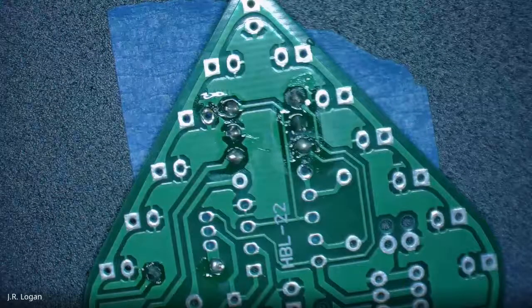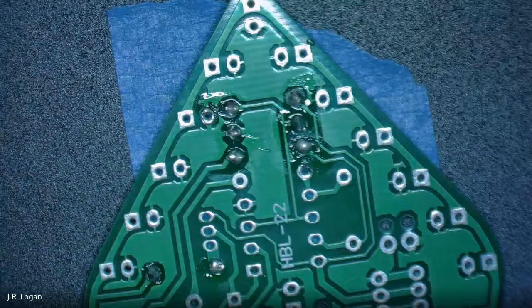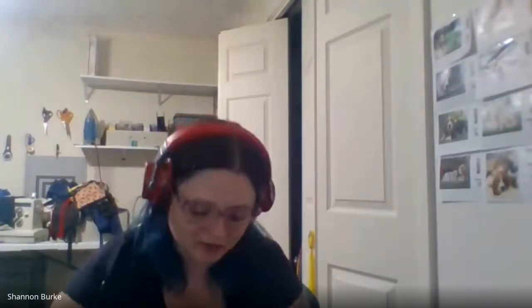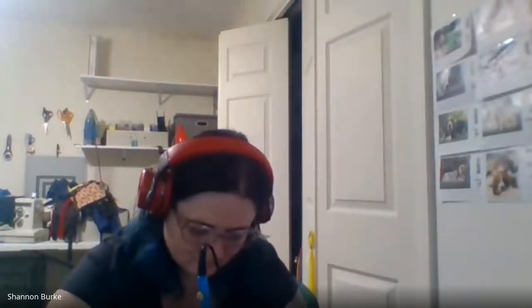Now we're going to do the next resistor. Does anyone remember brown, black, yellow? Go ahead. Pretty sure brown, black, yellow was the 100. Yeah. Well, let's double check to be sure. We don't want to get this wrong. Yeah. I know brown, black, orange is the 10. Okay. Brown, black, one, black is 0, and then the yellow is a 10K multiplier. Yeah, so that's the 100.